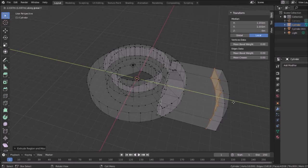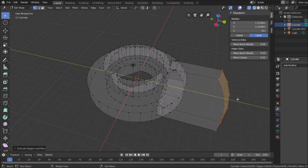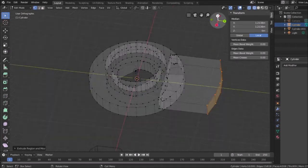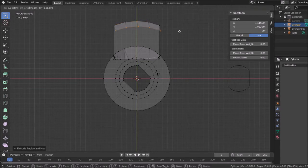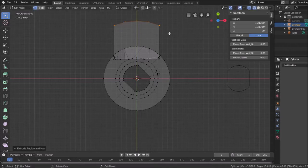So with this, I'm going to hit escape again because I want to get my measurements from my notepad. The sweep tab is 1.5 millimeters. So let me go back to top view here. All right, and then that's selected. I want to try something here real quick. Okay, it looks like the extrusion was already there. See, it was actually extruded to zero distance, so it was a matter of grabbing those and moving them. So I'm going to do this by the book again. I'm going to hit Control Z a few times to get me out of that.